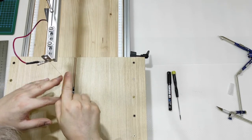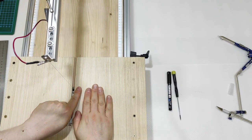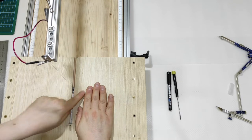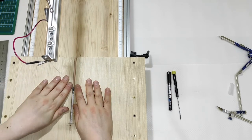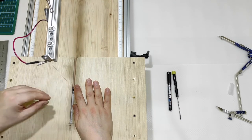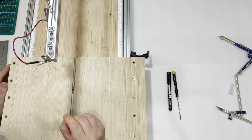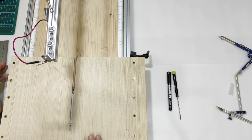If the wire is too hot, it will make a big cut in the styrofoam, because the heat will enlarge the groove made by the wire. If it is colder, but still able to cut, it will cut a precise and thin groove into the styrofoam, just the dimension, the diameter of the wire.